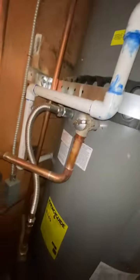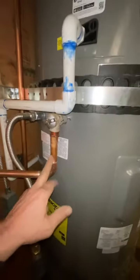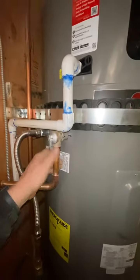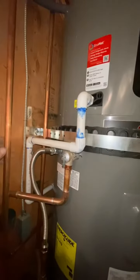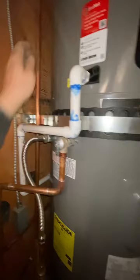They have an insulated floor. We've run rubber all the way around the straps. I've got rubber between the wall and the strap, rubber between every pipe, the mixing valve, everything. I've got two flex connectors on this unit, my bypass and temperature pop-off valve. I'm not feeling any vibration coming up through the pipes per se.